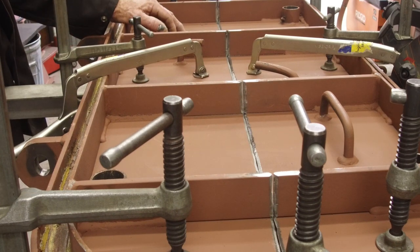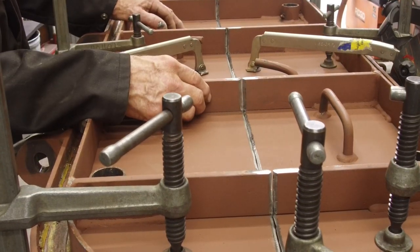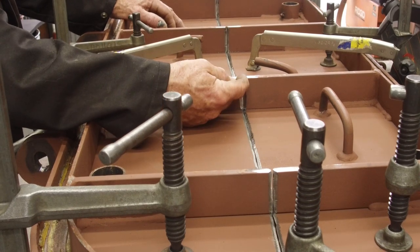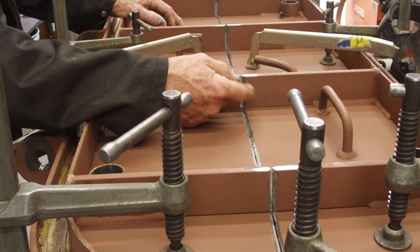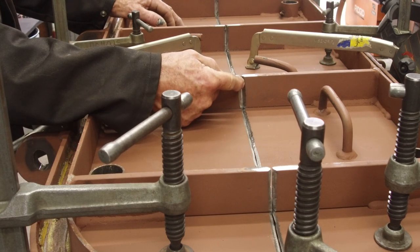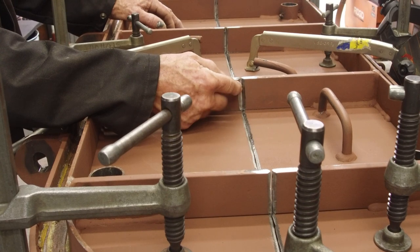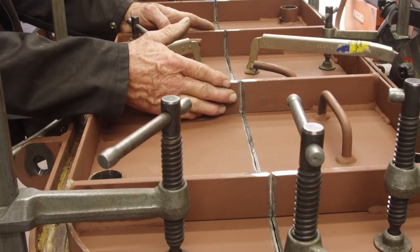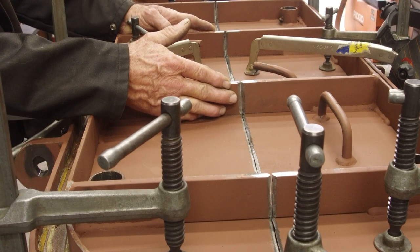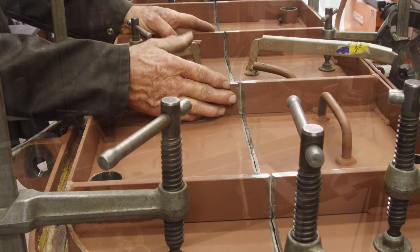We're going to use 3/32 7018, and we're going to go ahead and burn in, and we're going to do a vertical weld on each one of these, so we know that we're burning in, because the most important thing is 100% penetration on all the structural part of the door, and these four main members right here are the structural integrity of this bulkhead opening.